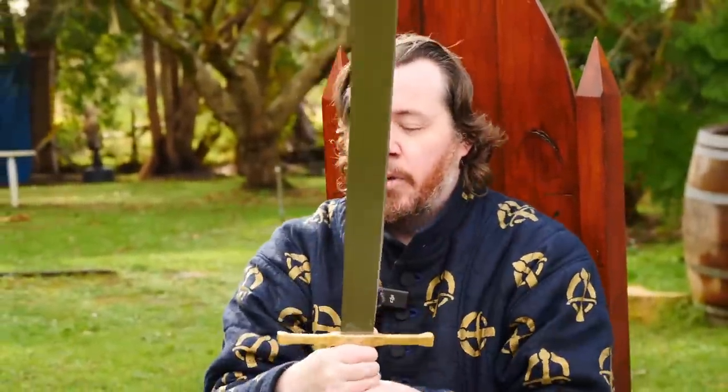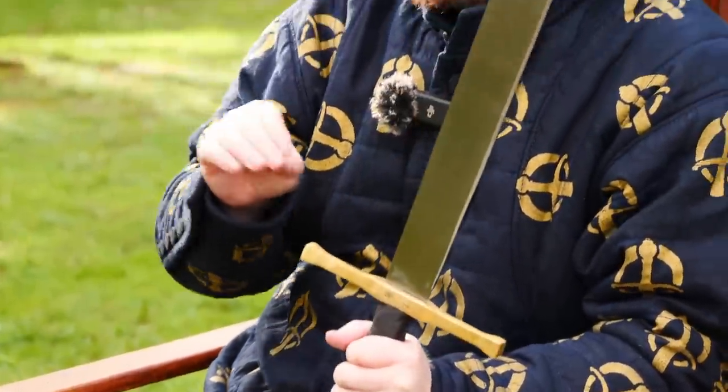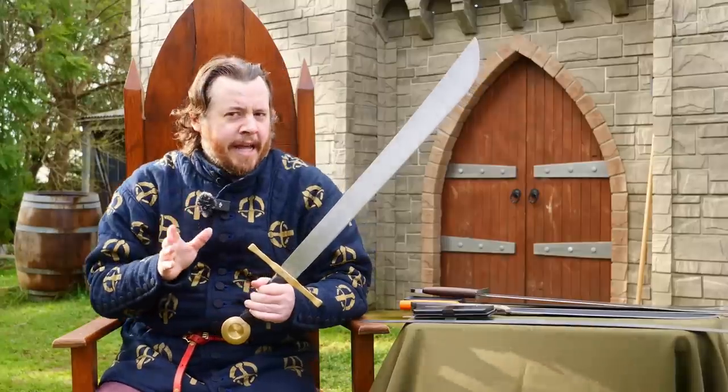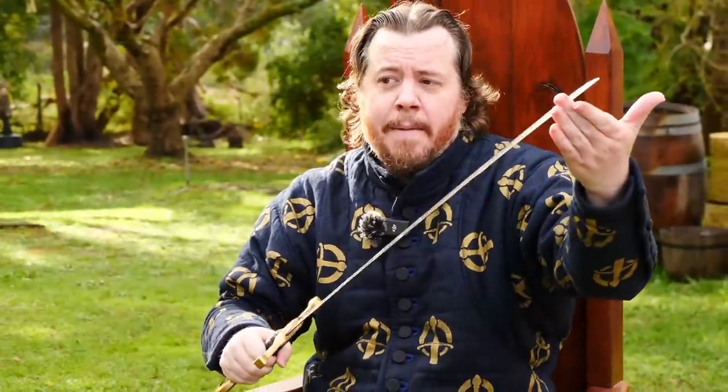Historical falchions are actually much thicker at the base, where this one is still very thin, which creates a different kind of weight dynamic in the blade. Type 1A falchions usually have a spine thickness at the base of around 5mm — though to clarify, that is the spine of the blade at the base, not throughout. It has a gradual taper creating a bevel all the way down to the edge, and they have a much more aggressive distal taper getting down to that 1.5mm at the tip.